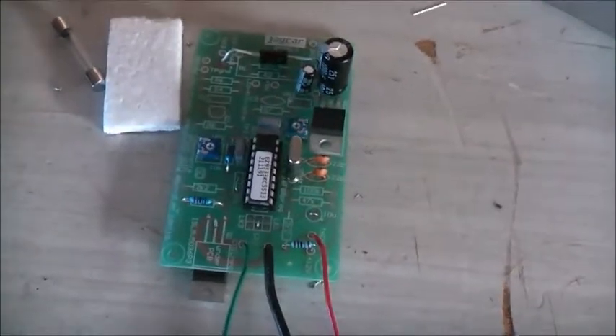Alright, let's start assembling. Viewers are ready to test — let's connect it up. There isn't really much involved in this one. Viewers, I've had a very bad connection here. One of my leads I was using as an extension lead — it had 12 volts at the right end, but on the other clip at the other end it only had 1.4 volts. That lead's buggered.